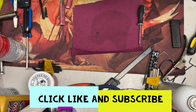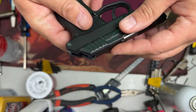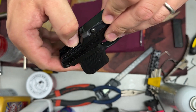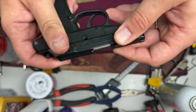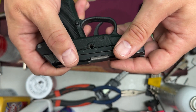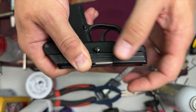With the hammer pulled — pretend it's already gone bang — when you try to slide this on it won't go, it stops you. Take your finger, cock it, and presto. You can see this little cupped-out piece right there. So pull it back just a hair, take this and put it in at an angle because you've got to push that spring down and then push it all the way through — and there you go.